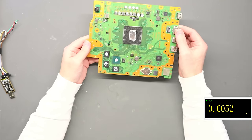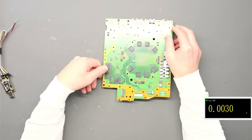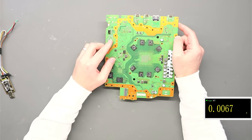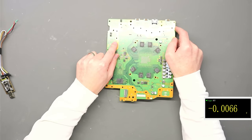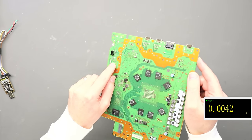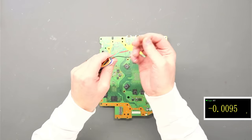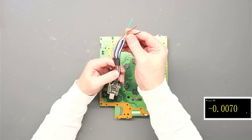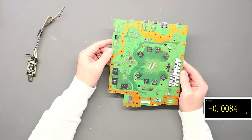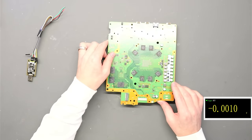What we need to do is connect our UART reader to the bus on the motherboard. On this EDM-033 motherboard it's actually here — you can see eight to ten pads in total next to the fan connector. That's where you connect the cables on your UART reader. One end is the USB into the UART reader; the other end has transmit, receive, and ground — only three cables. I'll put a link in the description with a diagram of how to connect all of these up.